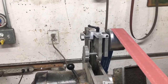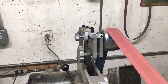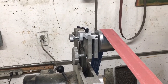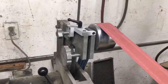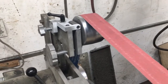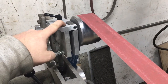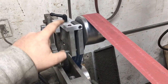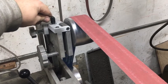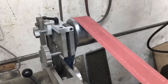Again, all credit to Reeder Products Inc. for the idea. That did get me thinking and sparked my own ideas for a similar mechanism, and that's what you see here. On this one, I did want to keep with the main theme of this machine, which is being able to adjust everything without tools. I do have one screw here that's pretty much at a fixed tension — it has a lock washer underneath it. But the main adjustment is just this knob, and then this is a tightening knob with a little slot milled underneath that washer to give it some left and right movement.